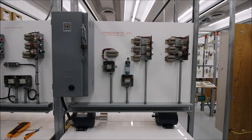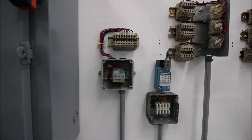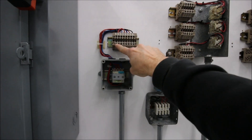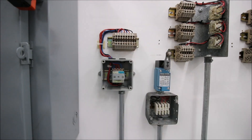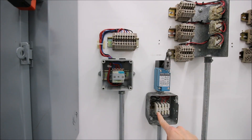This video is a follow-up on the ladder diagram for the two-wire and three-wire control. The wiring has been made as clean as possible — you can see the wiring harness coming from the relay, and the limit switch here. We've brought in two terminal blocks to save the actual components, so instead of replacing a relay base or an entire limit switch, we can just replace individual terminal blocks.